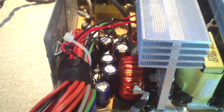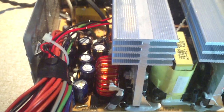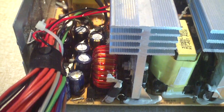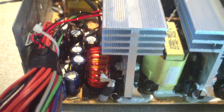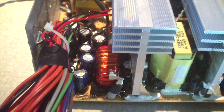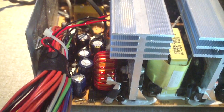So anyways, normally I don't make these kind of mistakes, so I figured I'd share that with you. And basically what happened was, like I was saying, the 10 volt capacitor was in a 12 volt circuit, and it took about 30 seconds, but eventually it did blow its top, and I discovered what happens when a capacitor gets overvolted. Anyways, any questions or comments, feel free to ask.